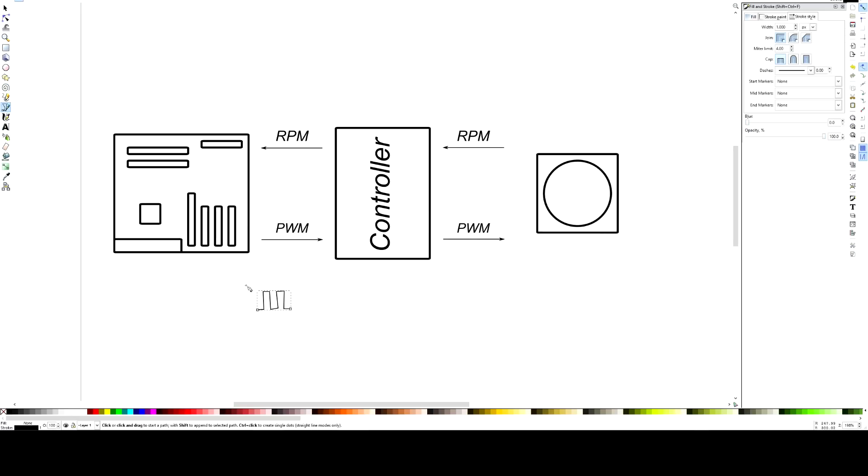The RPM signal is a 50% square wave, and its frequency is double the RPM. For a 3600 RPM fan, you'd expect the RPM signal to be not 60 Hz but 120 Hz — so 120 times per second is 7200 times per minute, equals 3600 revolutions per minute. Just to be clear, this RPM signal — even a really fast fan, say a 36,000 RPM fan — would still only output 1200 Hz as its RPM signal. On the other hand, the PWM signal is really fast; it's a 25 kHz signal.